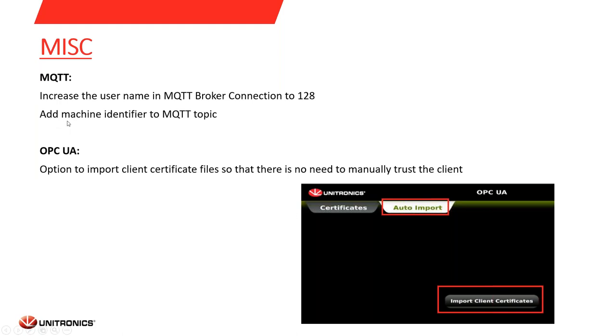In addition, we added what's called machine identifier to our MQTT topic. That means that if you have, for example, a lot of machines that are using basically the same application, let's say a machine builder is building 50 machines and is using the same application in all of these machines, but each time that he wants to publish or subscribe to topics, he needs a different topic, because if all of them will have the same topic, then we will have data overwritten. So now we have a new option, which is called PLC name. I can show you in a moment how it works.